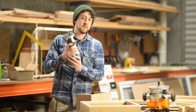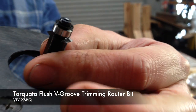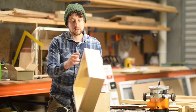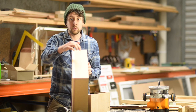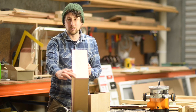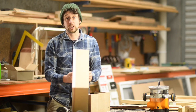The next bit is a V-groove flush trimming bit. It's a standard flush trimming bit with a little V feature just below the bearing, and it's fantastic for giving a really nice sharp shadow line, usually placed directly on the join of two pieces of timber. Instead of just trimming the front hardwood face flush with the cabinet, you can put a really nice shadow line between the hardwood and the face. That might just separate it visually - it can look really nice and sharp. It can also be used effectively if your join is just a little bit messy or hasn't come together quite as tight as you needed, because putting a shadow line in there totally hides that join.